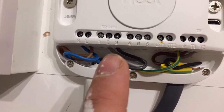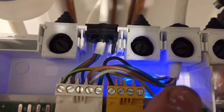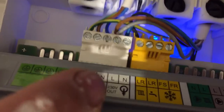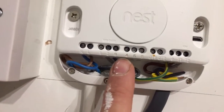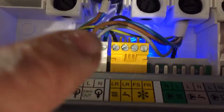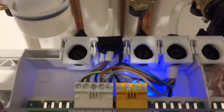There's a relay circuit inside the wireless box which turns the boiler on and off depending on the room temperature set by the controller on the wall. I've got a grey wire going into terminal 2 and a black wire going into terminal 3. The grey wire is the constant live running into the 230-volt section, and the black is acting as the switch live — telling the boiler to turn on and off — running into the radiator symbol terminal.